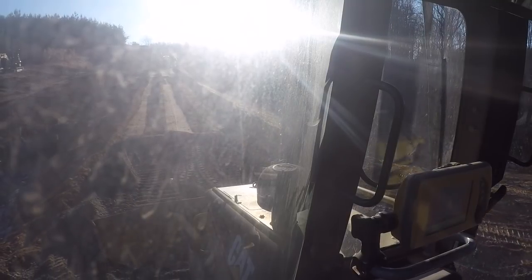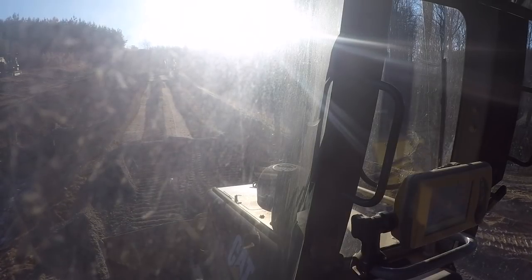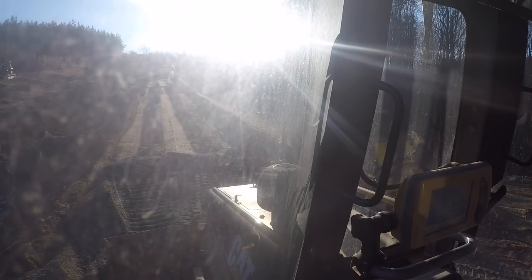Have got on the stone, and I've got my GPS set at a negative 0.48, which is subgrade, and then you add back the 6 inches, which makes 0.48. The subgrade is actually a negative 0.92, but when I checked it with the rover, you always go by the rover, not what the dozer says. The rover said I was still cutting at about a negative 0.88. So what I did was I lowered the dozer on down another tenth. So I was at, well, not quite a tenth.